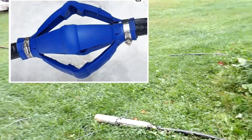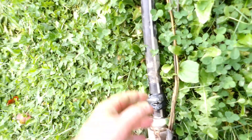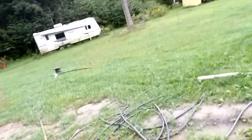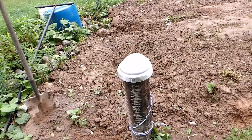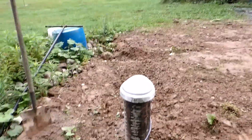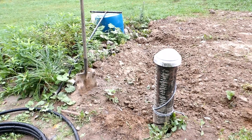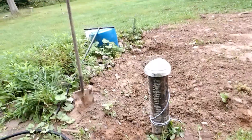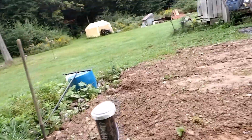The first guard is a torque arrester. You put the torque arrester right above the pump. When this pump kicks on, it'll keep it from slamming on the side of the well. There are some white ones that you put every so often on the way up so that pipe doesn't hit. My well is 52 feet deep and the bottom of my pump is actually sitting at 36 — well, it's 36 plus 4, so it's 40 foot, about 12 feet off the bottom. The pitless adapter is 4 foot underground, so you're well below the frost.